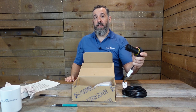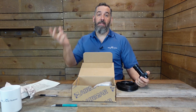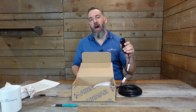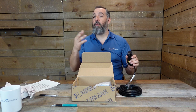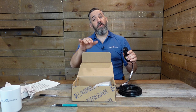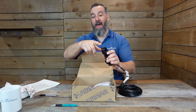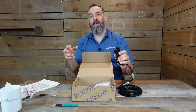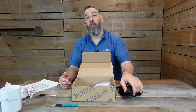What's interesting is you can actually have an insert go in. Most through-hulls are mounted from a hole drilled in the boat going outside in. This one has you install the sleeve on the outside and you can actually plug the transducer from the inside. This is important because with a speed paddle wheel, you get a lot of marine growth. Depending on salinity, water temperature, and where you are in the world, growth happens faster in some places. The instructions say to remove the transducer when not in use so the paddle wheel doesn't get clogged. If it has too much resistance, it will seriously skew your speed readings.